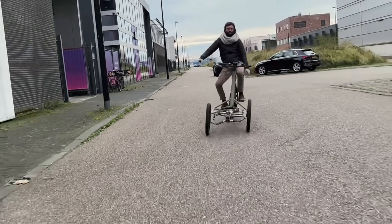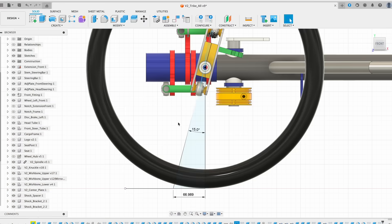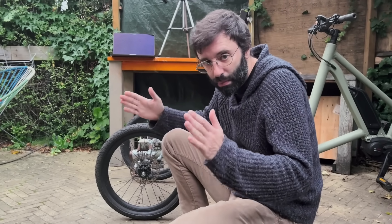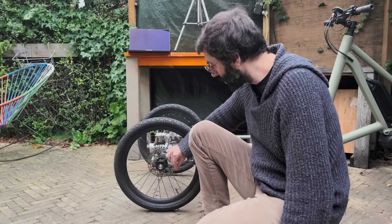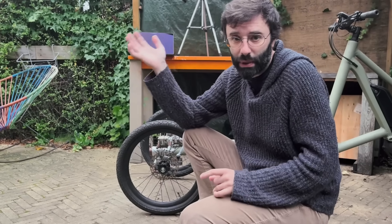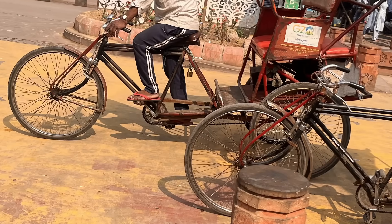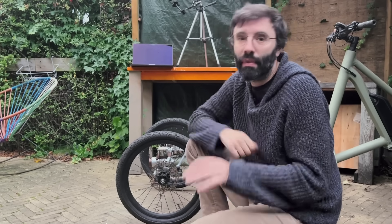What I'm thinking is I can improve that with trail. I have a caster angle of 15 degrees now, which results in a trail of about 67 millimeters — which sounds alright, but I think I can improve steering stability at low speeds by changing trail. The question I have for you is: should I move the wheel backwards to increase the trail, or move it forward? I was recently in India and noticed these delta trikes with so much forward trail. Do you know why they use so much forward trail? Share your knowledge — see you next time.